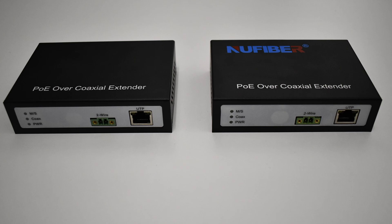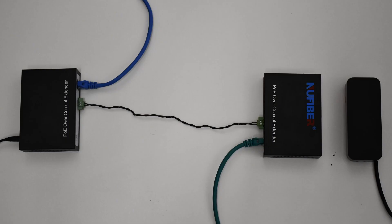This is a Power over Ethernet 2-wire extender. This device gives power and internet connection to the Kisi Reader Pro 2. It has two components: a PSE and a PD. The PSE takes an input of power and standard Ethernet, then converts this to a form that can be sent over a twisted pair wire. The PD then takes the input of the twisted pair and outputs a single Power over Ethernet cable that connects to the Kisi Reader Pro 2.